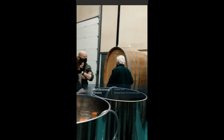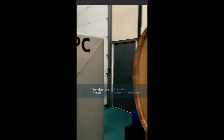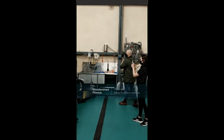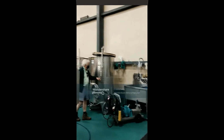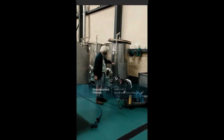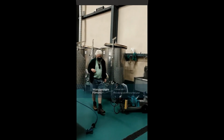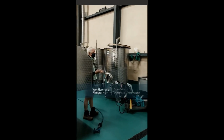Once the wine is juiced, pressed and settled, we put it into these heated tanks, which basically pump water around the jackets in the mechanisation behind, just to heat the tank. The water goes through at 60 degrees, and then you set the temperature. Normally we do about 20 degrees C. You can read the temperature here. You need that sort of temperature to start the ferments. If it's too cold, the wine won't start fermenting.